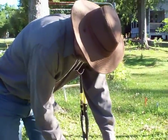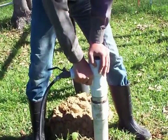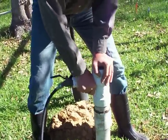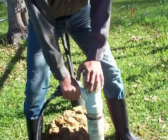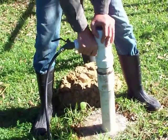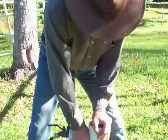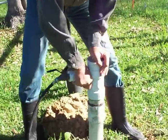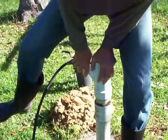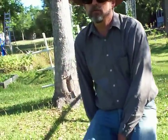We've got this in. Turn on the water — it's not a whole lot of pressure but just enough to keep water coming out. I made this one with a three-inch sewer pipe and sanitary fittings, which are not made for pressure. But because so much of the water is coming out the other end, it's not as high pressure as what's coming to the hose. When you're doing this, you can bounce it around to break things up, you can turn it. Another thing I like to do is just sit on it — you can feel a little crunchy feeling of the dirt breaking away as it goes deeper and deeper.